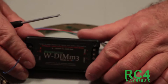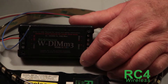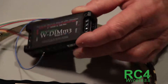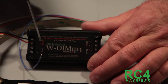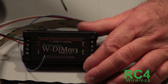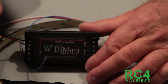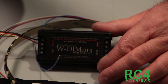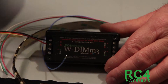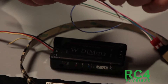On the dimmer, very conveniently, all RC4 wireless dimmers are also common positive, making this super easy. Common positive means the battery input's plus terminal is connected inside the device to all the other plus terminals, and the dimming action happens on the negatives. Two points to remember: number one, the common on the LED tape is positive; number two, the dimming action happens on the negative.